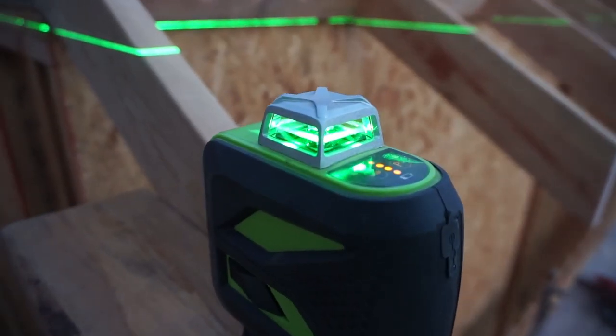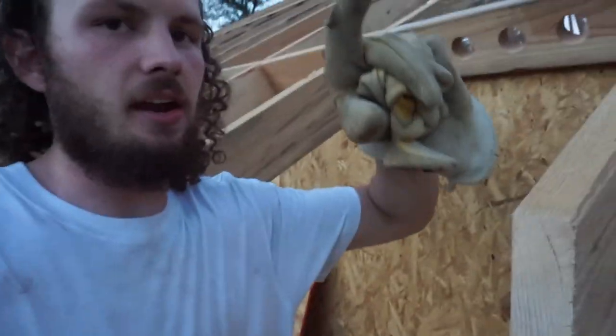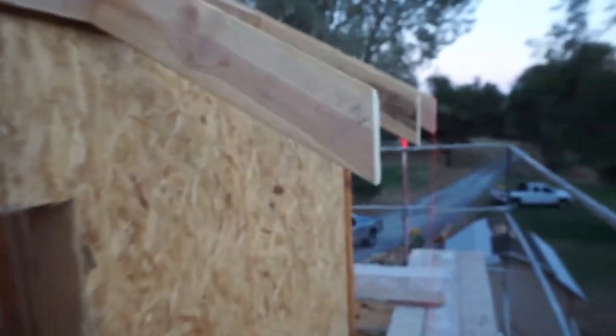For this next step, now that we have the fronts all squared off, we need to get the tops even. We had a couple checks for this. First, we ran a string line all the way down from end to end. But we were worried about the string line sagging, so we set up a laser level. All we did is measure from the top of this corner to that laser line to get our distances. Our goal is for this to be pretty flat from front to rear. So we measured out all these distances on each truss between the top of the truss at the corner and that level line.